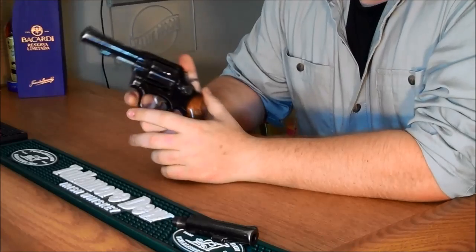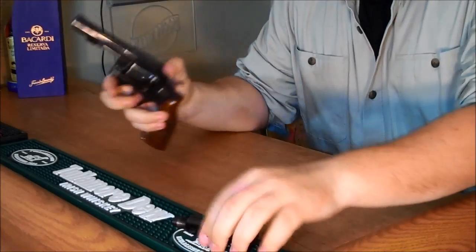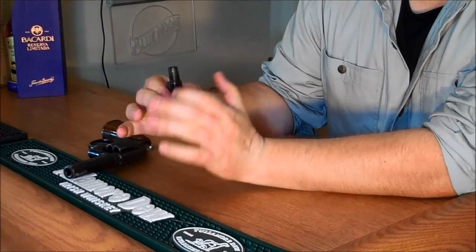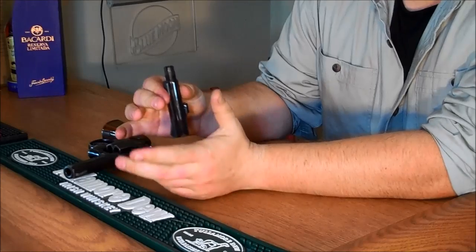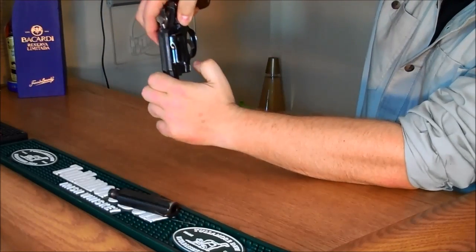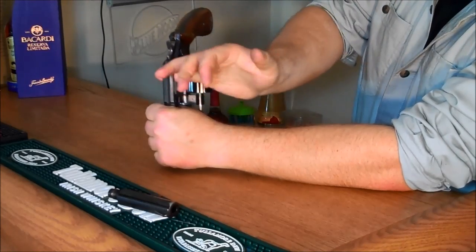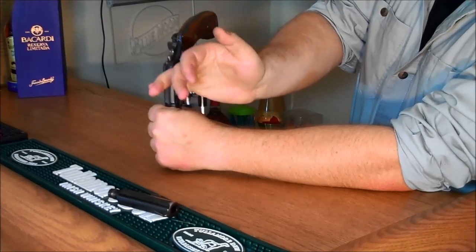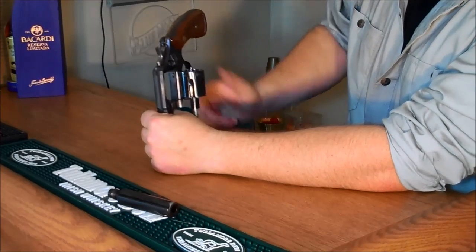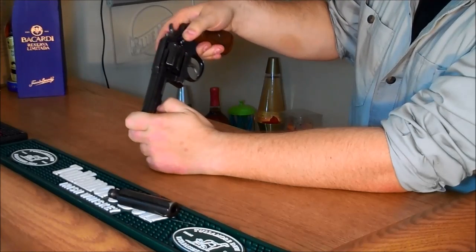The re-barreling process for me involved: first, I was worried about breaking the frame. So I chucked this part into a vise, took the pin out, shot some penetrating oil in to get the threads hopefully free, and heated it up a little bit with a torch. I had the cylinder out at this point. With the frame held firmly and heated up, I took a hammer handle and very gingerly rotated the frame. After a little bit of torque it broke free, everything came apart, everything was fine — the frame didn't get tweaked, there was no damage, everything was still straight.